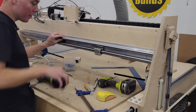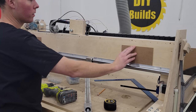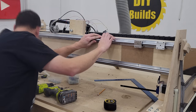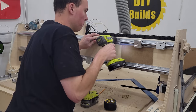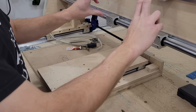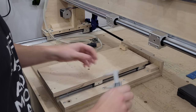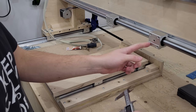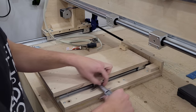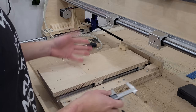Four and a half inch spacer. I've got my two spacers — four and a half inches — making sure I have my bearings on here. So our four bearing blocks are going to go approximately here, so I'll just mark them by measuring from the outside to the center of the hole, then score like this, and then I'll get my heights after the fact.